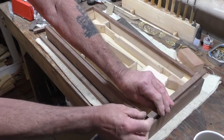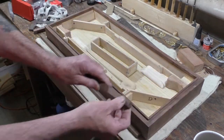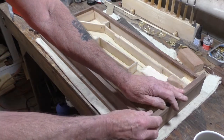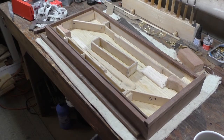I'm going to cut the tongue just like doing the dovetail — cut the tongue first, then use it to mark where I want the groove. I'll just pare things down with a chisel until they fit in there and everything sets level. And then I can put the top on and these will all be lined up.